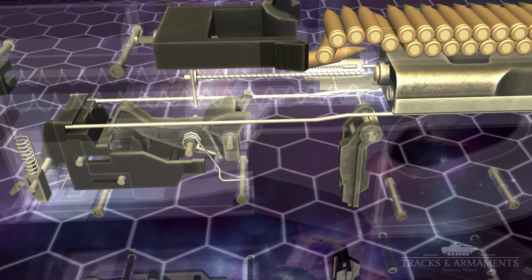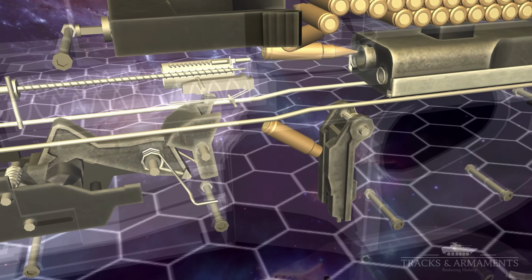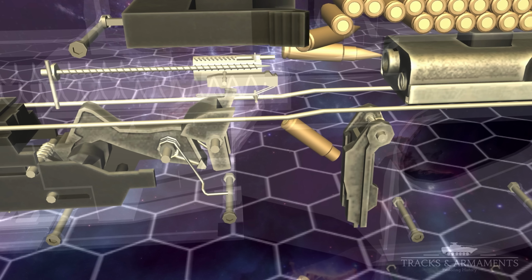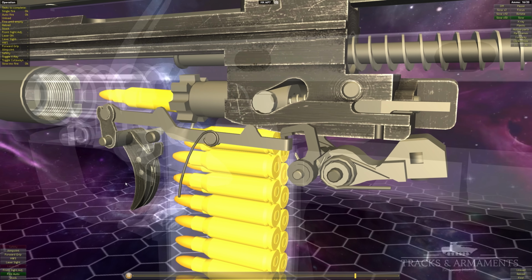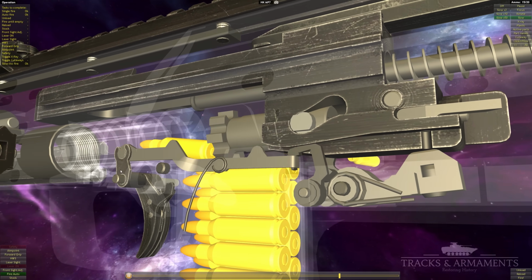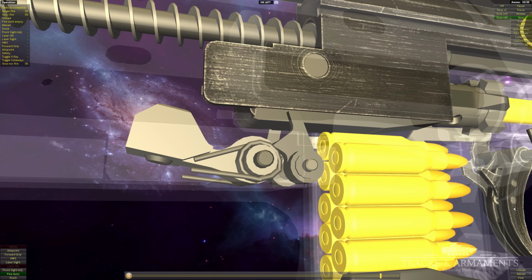In other military select fire guns, the disconnector is pulled back so that only the safety sear engages the hammer, and on release of the trigger hook catches the hammer. However, on the MP7, changing the fire mode allows the trigger bar to pull farther away from the hammer, keeping the disconnector disengaged from the hammer, which allows for the hammer to be retained only by the safety sear.